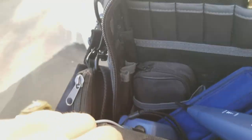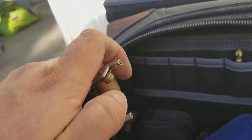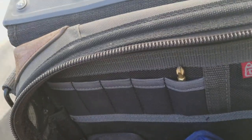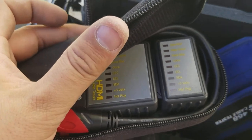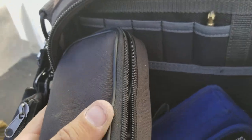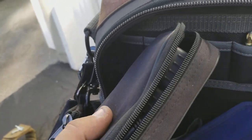I'll touch these together and release — you get a different sound, so really helpful when troubleshooting. I also have this — I got it for about 35 bucks from my supplier but I hardly ever use it. It's a continuity tester for HDMI — if you think there's a problem with an HDMI cable you plug this in. Like the other continuity tester, when you plug in the transmitter side you'll see the light so you know something's there. This does test HDMI.